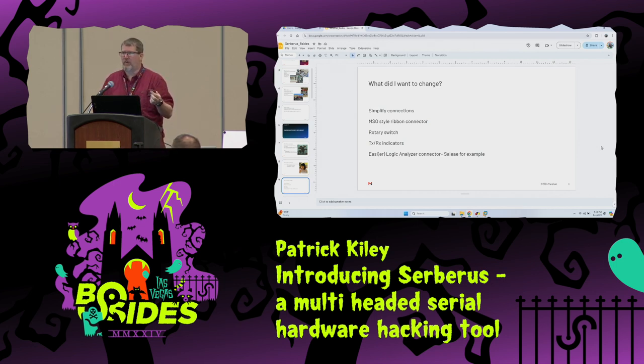For those of you who do hardware hacking, you know how much you use a logic analyzer. Having it directly on the line, without having to have multiple connections on the little tiny pins that you connect to, made my workflow a little bit easier. So we added that. And then it has a single little Cortex debug connector on it as well.